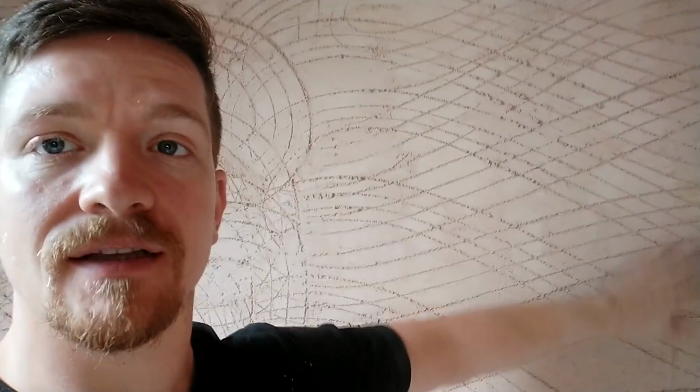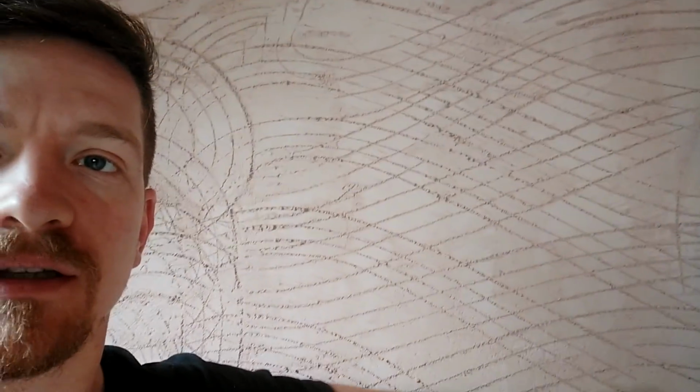Okay, so it's been about 3.5 hours. I'm going to get ready to skim it. First thing we've got to do is scrape back the excess. It's still quite fluffy. You can see it's turning now. The colour's starting to change. Now's a good time to get on it. We don't need to dry up really, so I'll quickly show you what to do now.